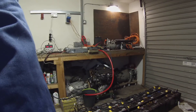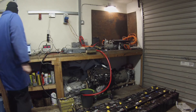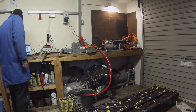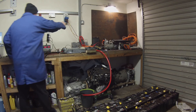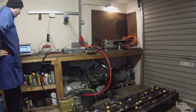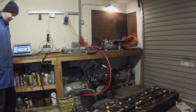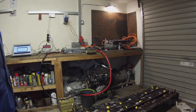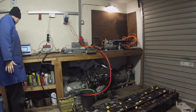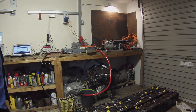We can get you guys in here with a pretty good view. So we're going to start by energizing the charger — and yay, nothing happened. Oh, the circuit breaker's turned off. Take two: let's go for it. Charger on — it should go through its initialization procedure. Yeah, there's some relay clicking. We wind up to our minimum current, putting about 2 amps in at the minute. Let's command 2 amps — that'll be 2 amps per module. We are now drawing 1.19 kilowatts from the mains and pushing just under 5 amps into our battery.